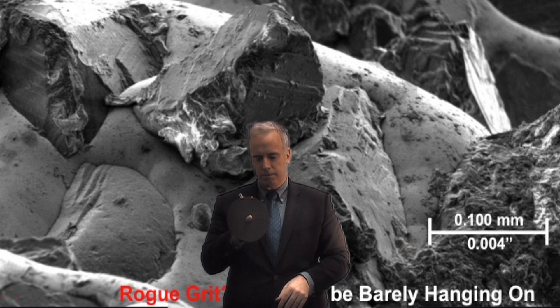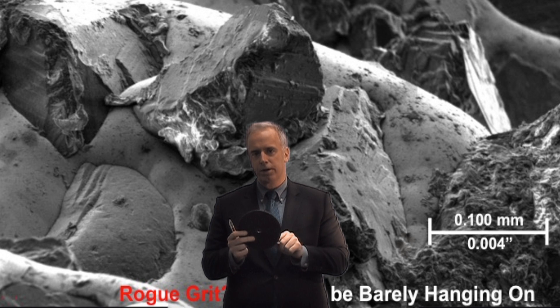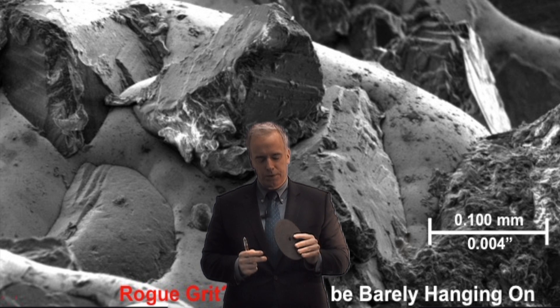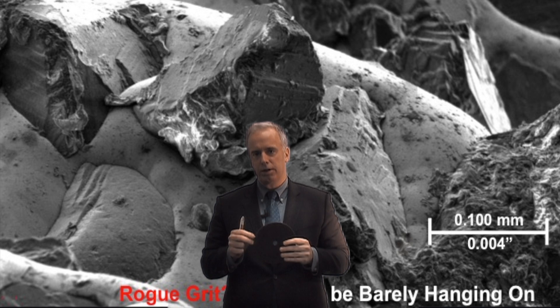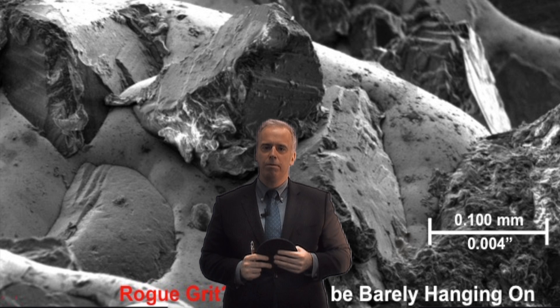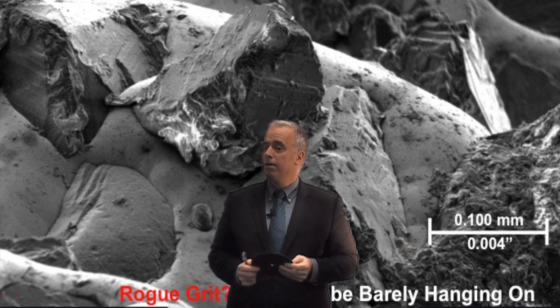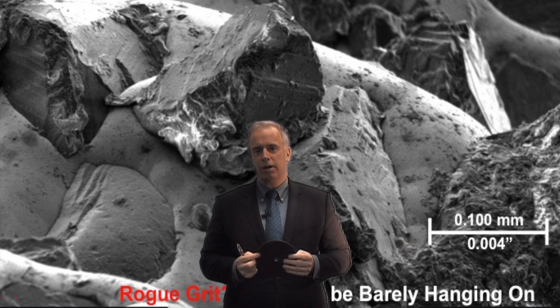We go to grind, those tall grits do the cutting, and we're kind of acting like a milling cutter. We've only got a few grits around the perimeter, so because we have such few grits, they take really big bites out of the material — very low heat generation, but very rough surface finish. Some ways you can cope with that: you can get a conditioned wheel. But even then, you're going to start off with a pretty rough surface finish from these rogue grits in electroplated wheels.